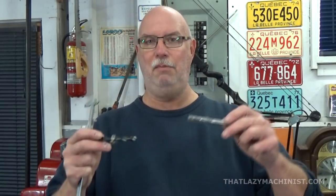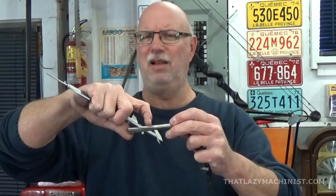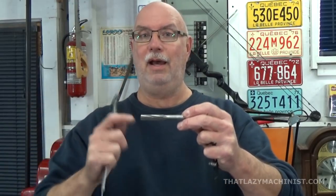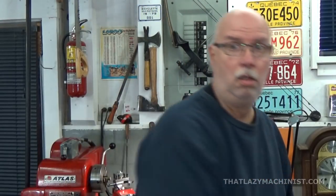And that's great, because that means that when I ream, I'm going to ream right up to where the teeth end, just barely a little bit past it, and that will ensure that the end of the reamer will not bottom out in the hole. That's important, because if your reamer bottoms out in the hole, it's going to go askew and oversize your hole. So there we go. I'll produce all that without any actual measurements. But it all starts with two things: the surfacing of the end and producing a good center hole. So let's take a look at that.